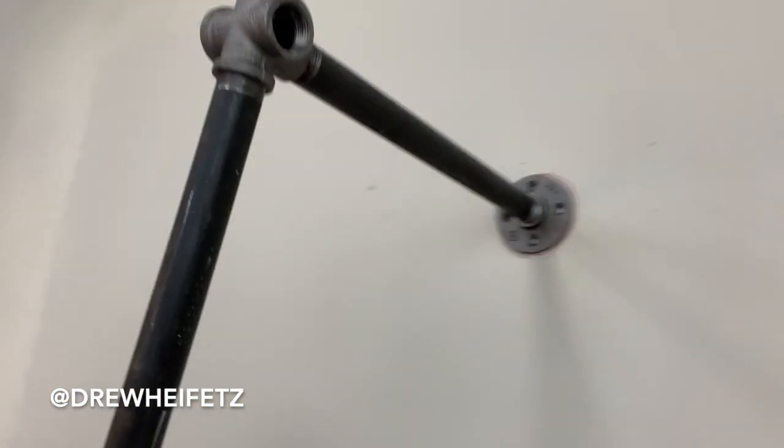It's been about two days. I've been working hard. See here behind me? The wall is cut open. I had to put some support braces between the studs to hold the floor flanges. You don't want to screw into drywall — it's going to come out, your racks are going to suck and not be strong. So I had to do three, four big holes in the wall, put the supports in, put the drywall back, putty it all up, and then repaint. Then I'll be ready to put the rack up. It's a process, unless you're screwing into wood, which is super easy. Anyway, extra step for me, not for you hopefully. I'm just finishing the painting, then we will make the rack.